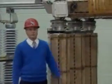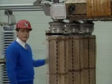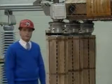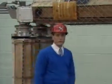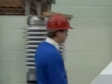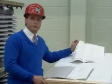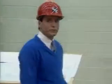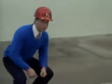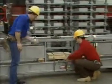You'll note that the interrupters and insulating support columns are equipped with protective wrappers. Don't remove any of these wrappers until the installation has been completed. Do, however, remove the information kit. It includes detailed instruction sheets, drawings, wiring diagrams, and other information you'll need to complete the installation. You'll also note that we're using heavy steel plates in place of the usual concrete foundation. Our installers, Bill Imlaw and Steve Staffen, will demonstrate the step-by-step assembly procedures.